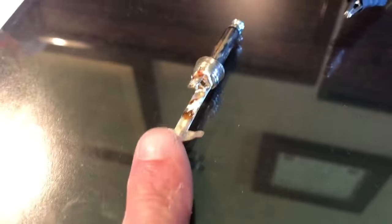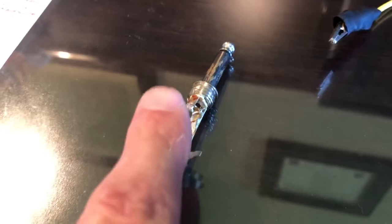The 20 gauge wire — I marked it in black — is going to be for my ground, and then the 18 gauge is marked in red, that'd be for the hot side. So what we do is we connect the negative to the sleeve and then the red positive to the tip.